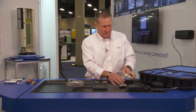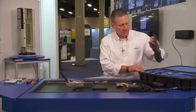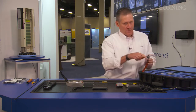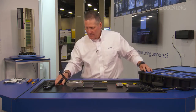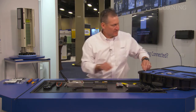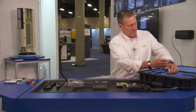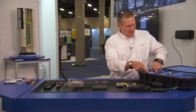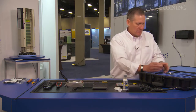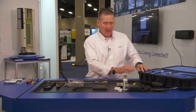We have a jacket removal tool to help remove the sheath from the Rock 900 cable. Crimp tool. Some side cutters. Two Sharpies. Some Miller strippers. Some fiber prepping and cleaning materials. And then the handler for the cleaver for the Rock 900.